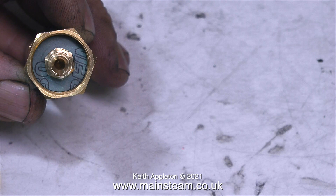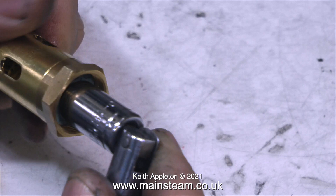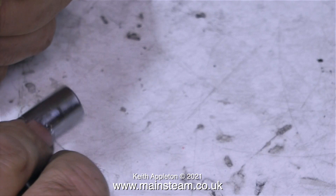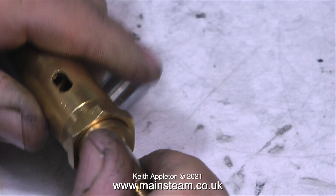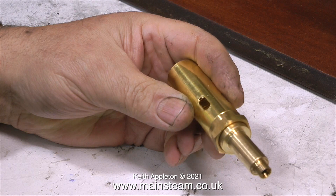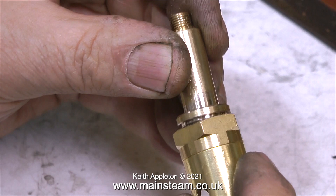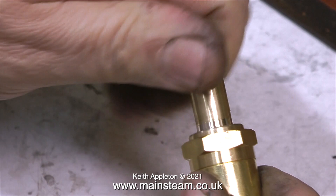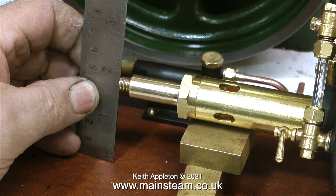This clip shows the burner head fitted with a 5/16 by 32 threads-per-inch steam union. Normally I would fit a steam union like this using some Loctite 542 thread sealant, but this is just to illustrate that I'm not going to use one of these — I want to make a mounting that is integral with the gas connector, so it looks like a purpose-built unit, not a lash-up with a jubilee clip. Even though the adapter doesn't screw into the internal threading on the blowtorch head, I turned the outer part to be a nice snug fit in the thread itself. With some Loctite 542 on the internal thread, as well as a silicone O-ring between the adapter and the burner head, this should make it perfectly gas tight. I cut a recess so it fits within the O-ring, and when I screw it together it really is a very firm fit.